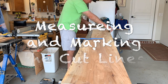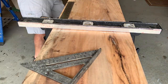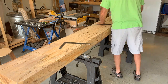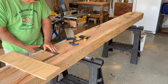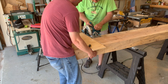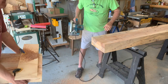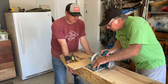I'm marking the cut lines on the piece because it's important to mark the top, bottom, and sides with your lines so as you make your cut you can stay on the line and have it smooth — you don't have a lot of rough edges to deal with later. I'm cutting both top pieces before turning it over to cut the underneath side. Since the cut-off piece is reasonably heavy, I asked Nathan, my neighbor, to help so we didn't drop it on somebody's foot. The cuts came out nice and smooth, and we moved on to the other end with the same process and same results.